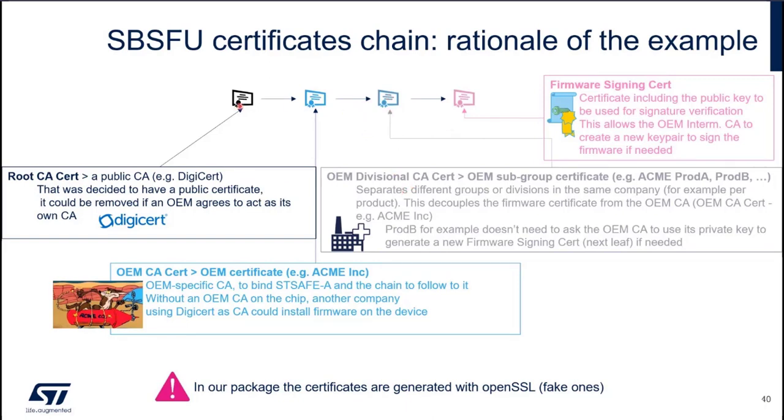When you check the certificate chain, you know from which factory it's coming. And finally, we have the LEAF certificate. This is the one signing the firmware, and this is the one we will use to verify the firmware authenticity. This one can also be multiplied — in the factory you can sign several certificates, one per operator. This way, you know from which line of production your device is coming. This is the transfer of responsibility.